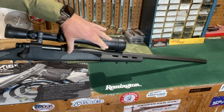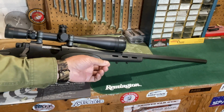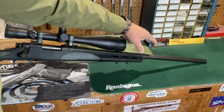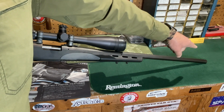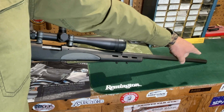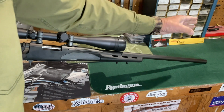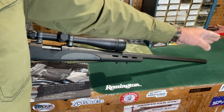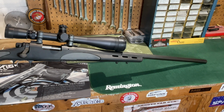When the cartridge is fired, the barrel vibrates. This is known as barrel harmonics. And the barrel, as it vibrates, causes the muzzle to move slightly, and I've had this described to me by people that have high-speed video as looking like sort of a figure eight when it's viewed under those very high-speed conditions.